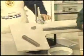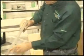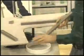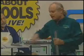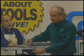These are my strips. They usually are 10 or 12 foot long, depends on what the sheet material is. As you can see, this is the squeeze out on the back side. That will be my top side here. The factory finish will be my face side. All my decks are cut to an 1/8 of an inch or a 1/16 of an inch oversized. So all these pieces will be eyeballed set back to the front edge.